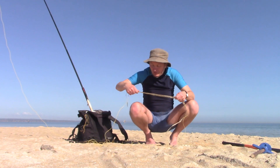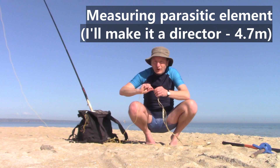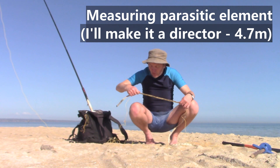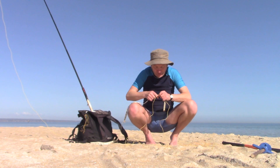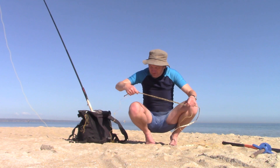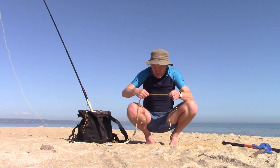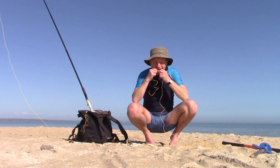I'm going to try this as a director. The driven element is normally about 5 meters long for 28 megahertz, so you need the director to be around 4.7 to 4.75 meters. I've just measured off 3 meters — that's 4.5 meters — and 4.7 is about here.